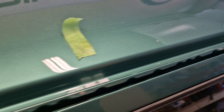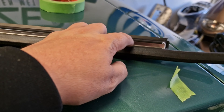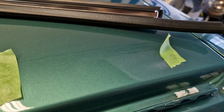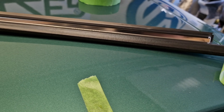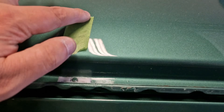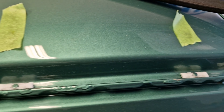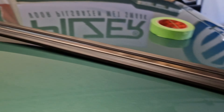At first you have these little clamps. I ordered them new, so whole new clamps everywhere. You guys may ask: why is there masking tape on the roof? Well, that's because of the little clamps. The gutter has some metal piece in here, and if you just press everywhere it will be bent to another form. So I place these little tapes on the roof. There is a coating on the roof so they won't fit very well, but they will stay there to remember where the clips are.